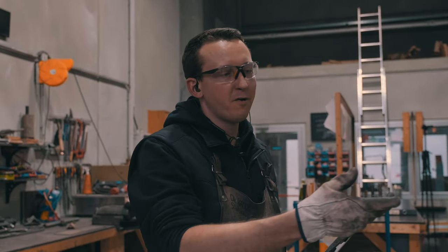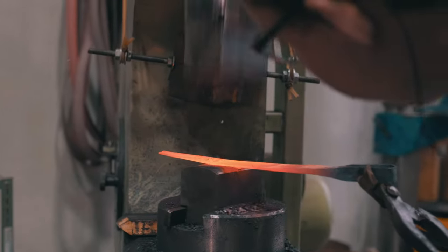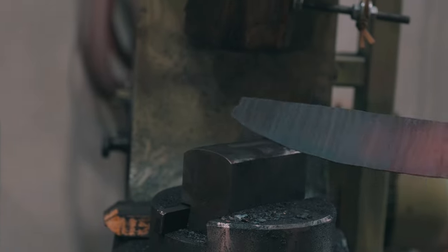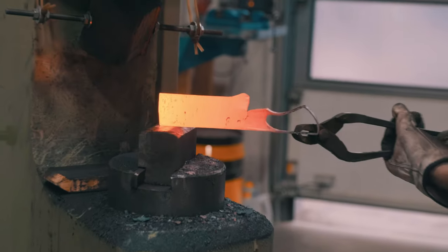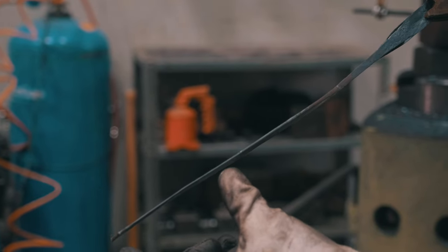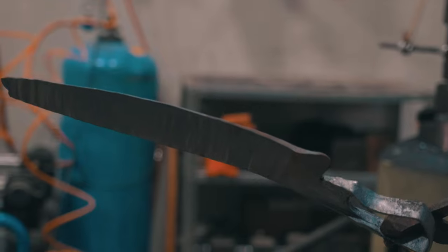A lot of movement — this is the first time we use the power hammer to its full capacity. With the half-round dies they move a lot of material pretty quickly. We started with a rectangular piece and tapered it down already. That will be the end thickness on the spine. Just the front part of the tip will be ground so it continuously tapers to zero at the tip. Now we'll forge the height a little and then that's done.